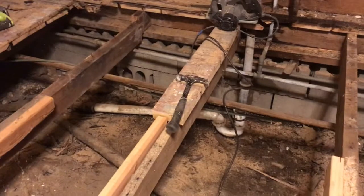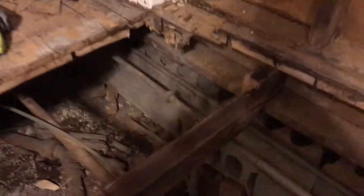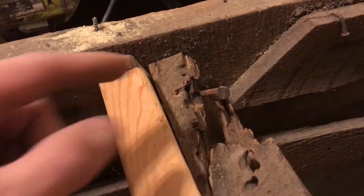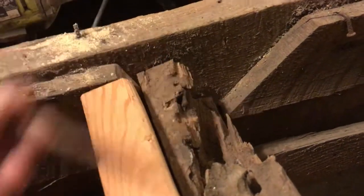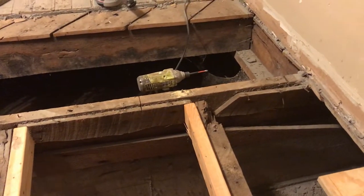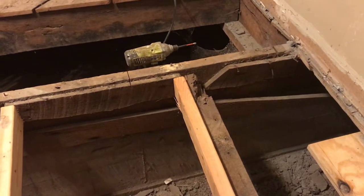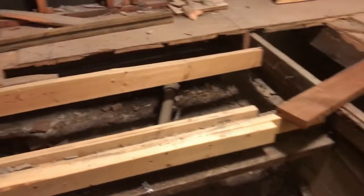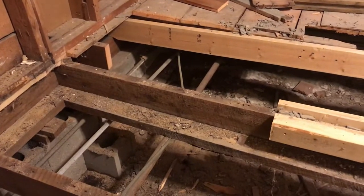I've torn out a lot of the flooring, exposing the joists and the bad shape they were in. Starting on this first joist — I cut it down here because I'm going to replace all these. At the other end they've got a little ledger board helping support the joists, but it's broken loose with just one nail, and that joist is free-floating. Lesson to be learned: when you open something up like this you're going to find further problems, but it's best to fix them all while you have it open, since you can't pull the floor up easily again.